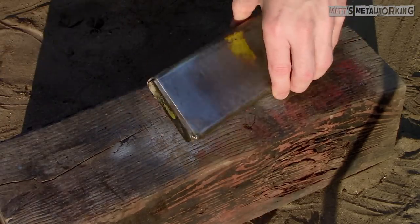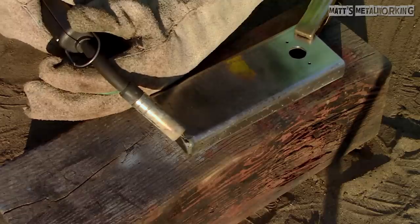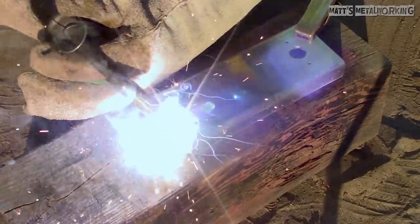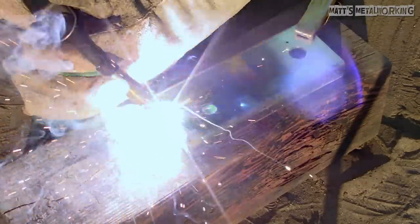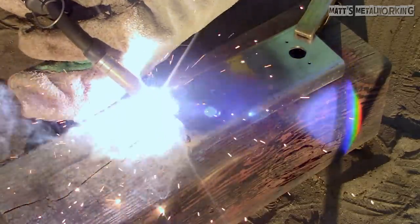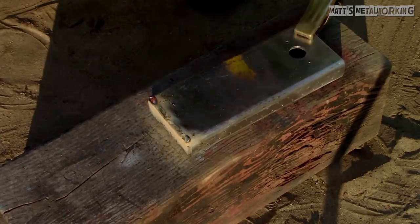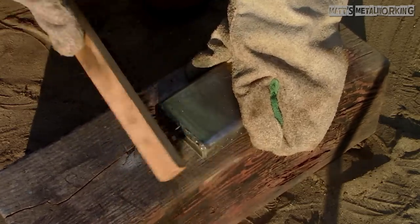Those tack welds will need to be cleaned up using a wire brush. I'm using a flux core welder so slag is present and needs to be removed when applying new welds. Running beads now — I'm using a small hobby welder which only has a high and low setting. This is thicker steel so to ensure proper penetration the highest heat setting is used. The wire is 0.035 inches or 35 thou in thickness. When welding, welders have duty cycles — you can only weld for a certain time and then the welder requires a cool down period so it doesn't become damaged internally.